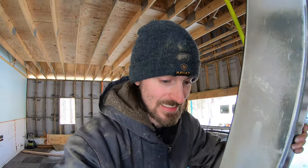I can't just go out and cut a bunch of 22.5 inches because some of the trusses are a little off. And then you've got the gussets that are in the way. Then you've got the hurricane straps and the other straps that I put down. Everything is just in the way, creating a big mess. And because I'm using 2x6s, it's very hard to push the 2x6 into the hole where it needs to go, and then hammer it flush and then get the nails in.